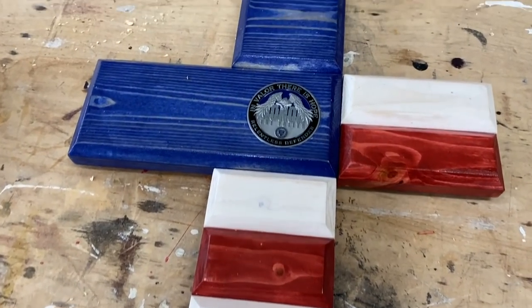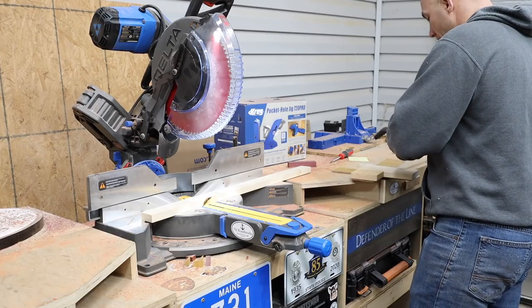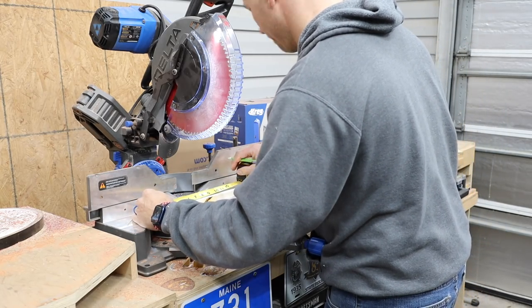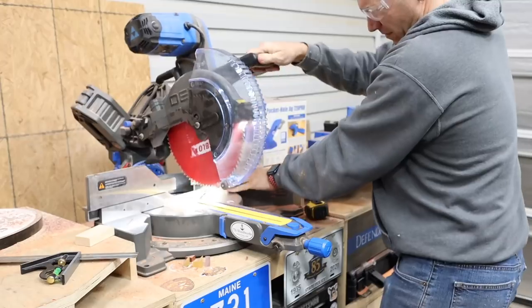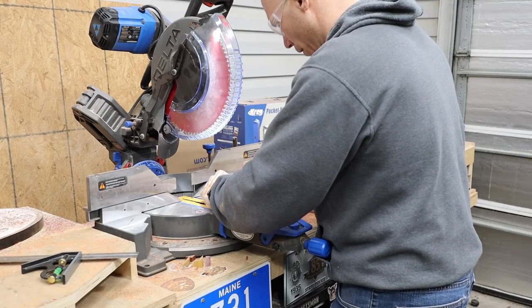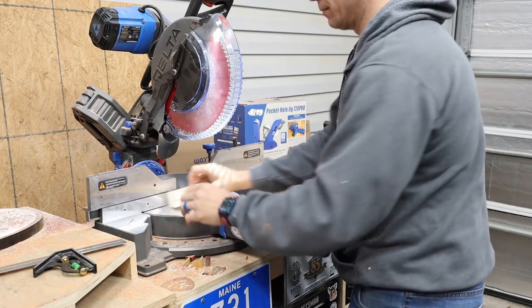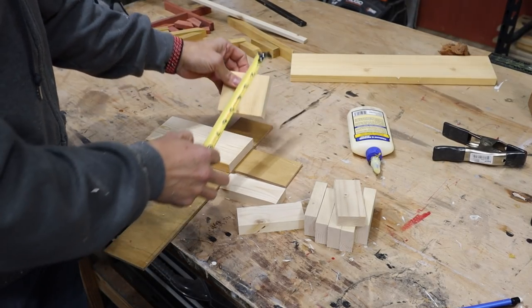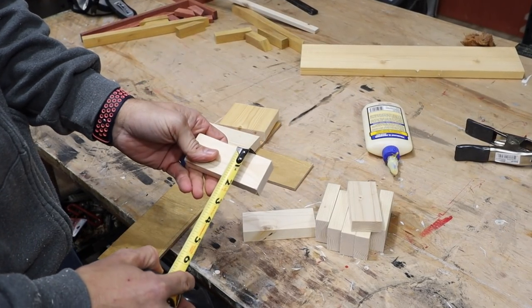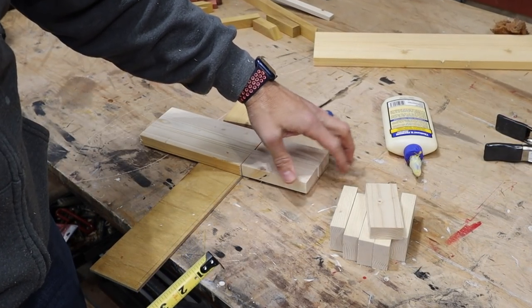So if you're building one like this, this is 1 5/8 inch wide, what I just ripped. And then we're going to cut 6 of these 3 1/8 inches. Let's do 3 1/4 just because we want to. I need two 4 1/8. Look at that. So we got this piece at 7 1/4. This piece is at 3 inches. These are just 1/4s. Then I took a 1/4 and ripped it down to 1 5/8 by two pieces at 4 1/8. Bada bing, bada boom.